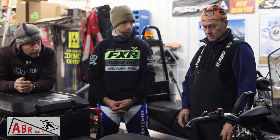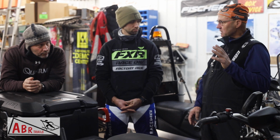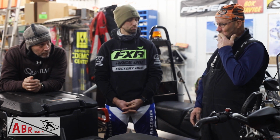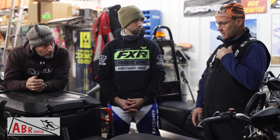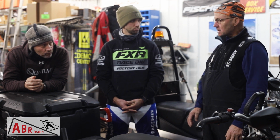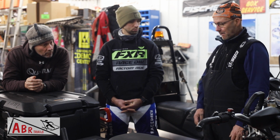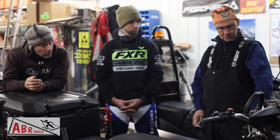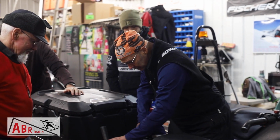Rick will show you when you're testing the groomers not to leave the actuators up all the way against the clutches where they go tick, tick, tick, tick. Just back them off a little bit. The electric actuators that run our groomers are $500 linear actuators. They do have some issues with moisture and cold and wear, but they are real nice for adjustments. There's two 30 amp fuses and I believe they're in here. Yes.